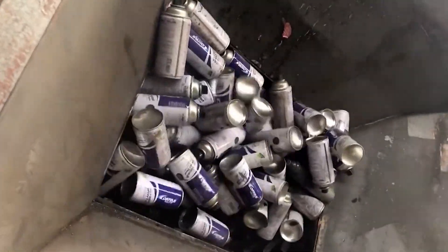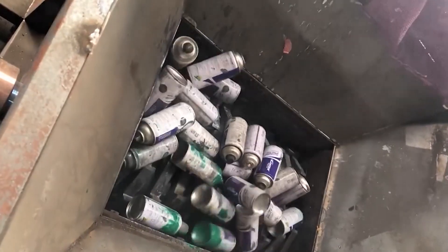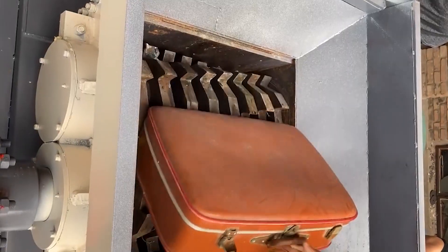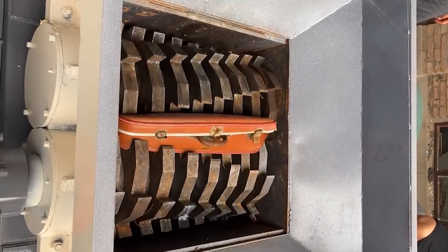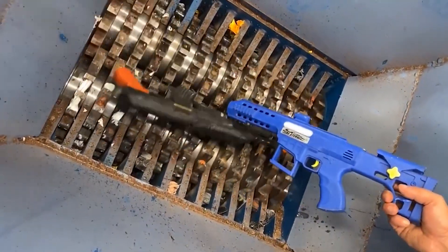The movable cutter adopts D2 steel and undergoes multiple heat treatments. The overall hardness and toughness of the cutter material is the same. With high strength and service life, the tool can be used repeatedly, and tools with blunted edges can still be used on the basis of the original thickness. The tool shaft is made of high-strength materials through quenching and tempering after high-frequency processing; the hexagonal shape is milled again, and the force on the cutter is not afraid of damage.